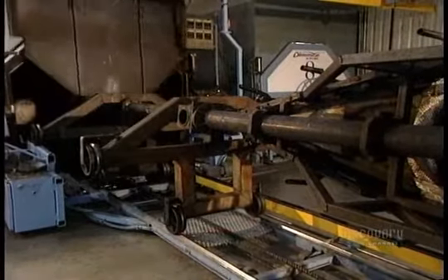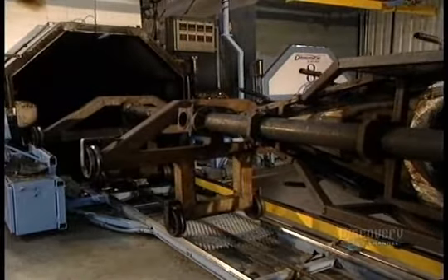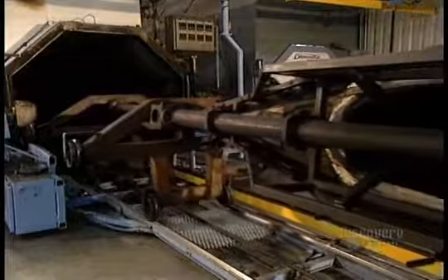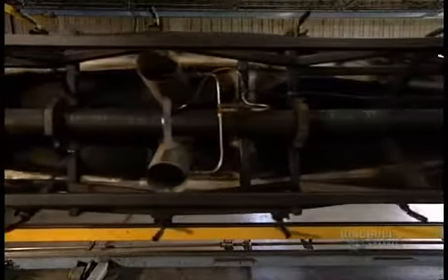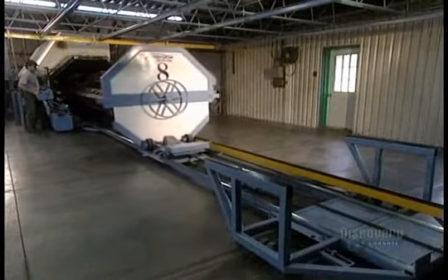Because of the large dimensions of the craft, the oven has to be custom made — the whole kayak goes in. The oven is seven meters long and has a diameter of 1.7 meters. The polyethylene melts at 288 degrees centigrade.